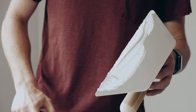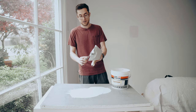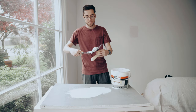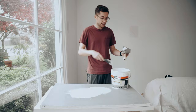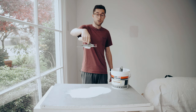Take your knife and get the stuff off the edge of your trowel. Clean your trowel, grab what's on the other end, and now you have a clean trowel. You probably need more plaster, so go ahead and add some and incorporate it together. Get used to doing this motion — it helps you practice getting the plaster where you want it. Controlling the product is a big thing. The plaster pretty much stays on your trowel, so just get used to the feel of it.